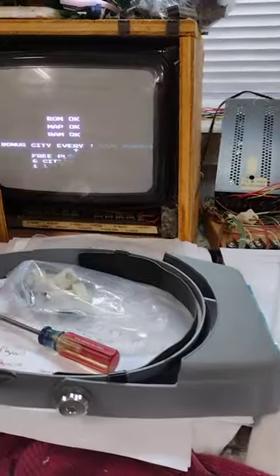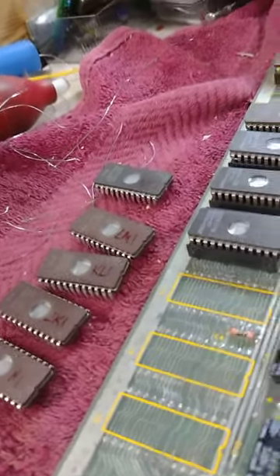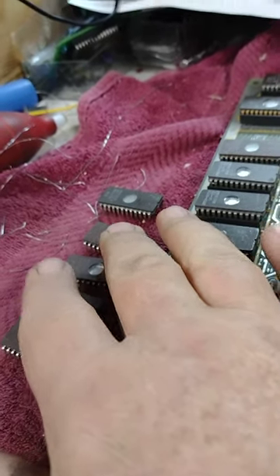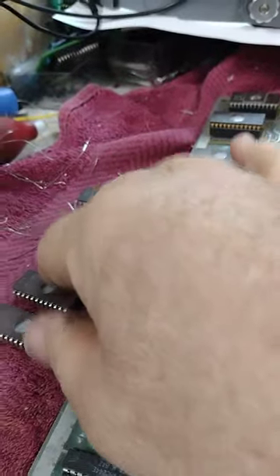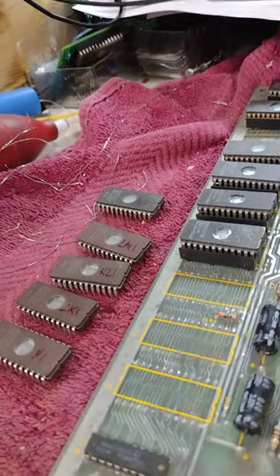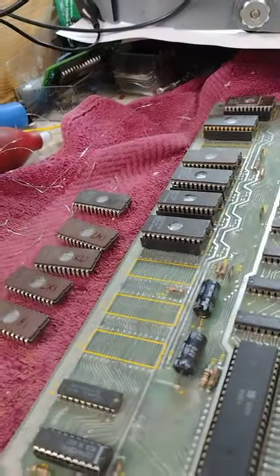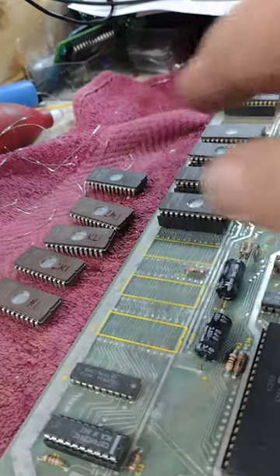I've tested the game and it's working. These original ROMs may actually be good — they might just have a different version of the software. They may have a very old version where only five high scores were saved, whereas a later version stored eight high scores. So this may be the five-high-score version of the firmware. The R1 ROM with the X on it is either the wrong one or bad, and that's why it's not running. The board won't boot without certain ROMs, but these ROMs from the working board fill that need. The R1 code is likely bad or incompatible, but the board is working and that was my goal for this video.